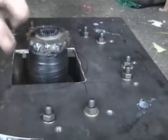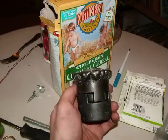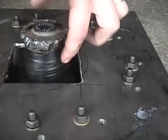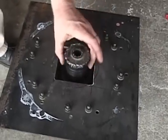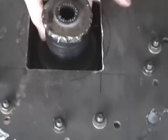I'm going to have to seal that little final piece there. This piece at the top that's been welded on was taken out of the clutch hub, and it was welded onto a Lovejoy coupler. The bottom piece that you can't see is another Lovejoy coupler that connects to this top one, and the bottom one just sits — it has a keyway and it just sits right on the motor shaft.